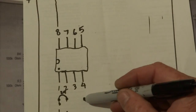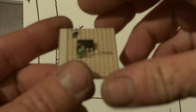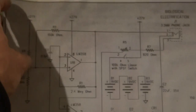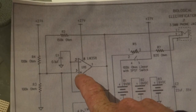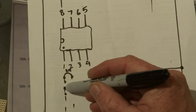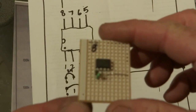The next step: you want to get the 150 ohm resistor and go from number one to number three. On this one here, it goes from number one with the 150 ohm resistor to number three. So basically on the board, the resistor goes from there to the pin that comes out on the track at number three — it should look like that.